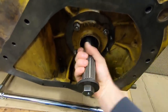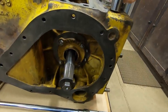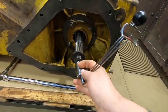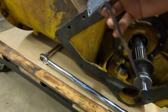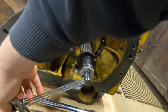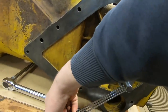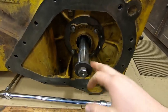One thing you always want to do is put several revolutions on the shaft before you take a measurement - that just helps center everything and equalize it all out. The stop bolt comes into play here; that is the handiest thing. Using a small beam-style torque wrench - we're right about 20 pound inches right now. I am liking the feel of that. I thought we'd have a lot more trouble than that; I can't believe that initial shim pack setup put us that close to where I wanted to be.